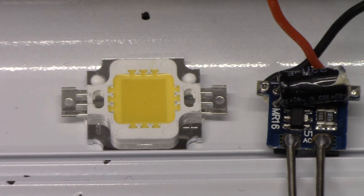Here's a closer view of the LEDs and the drivers. The LEDs in question are really generic 10-watt LEDs I purchased off of Banggood. They are three-in-series, three parallel strings COB LEDs, which are warm white and seem to be of reasonable quality. I did the test where you run them at a very low current in order to judge their quality, and all nine chips in them seem to light up extremely evenly. They also seem to be quite evenly matched across different LED modules — most of them were within about 10% tolerance in current and voltage.